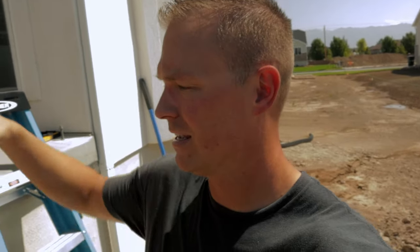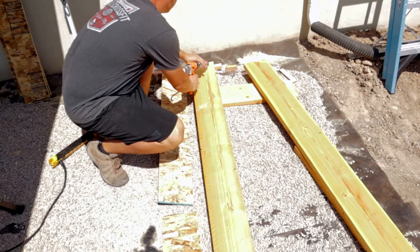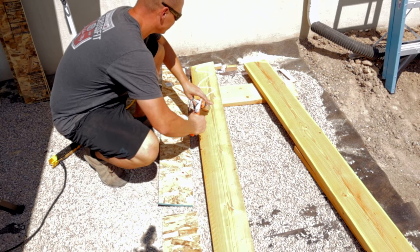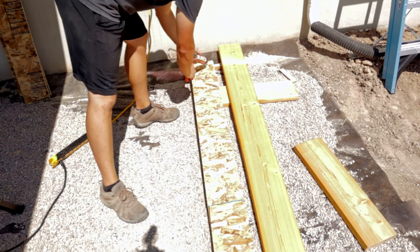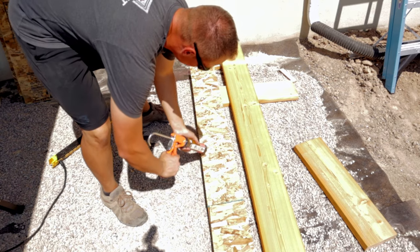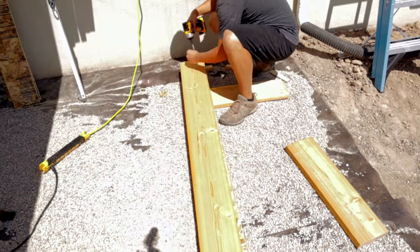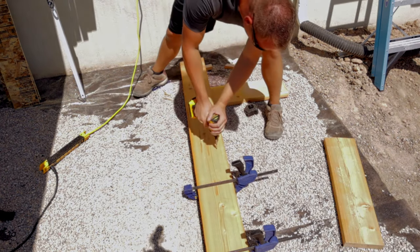One of the issues when making this beam and laying it in the brackets is there's a little gap. Making a beam is pretty easy — you're basically sandwiching half-inch plywood between two boards. This gives you that four-inch thickness needed to fit snug inside the bracket. You probably can get away without construction adhesive but it doesn't hurt to use it. On the ends of my beams I put two screws and then stagger a screw on the top and bottom about every 12 inches.